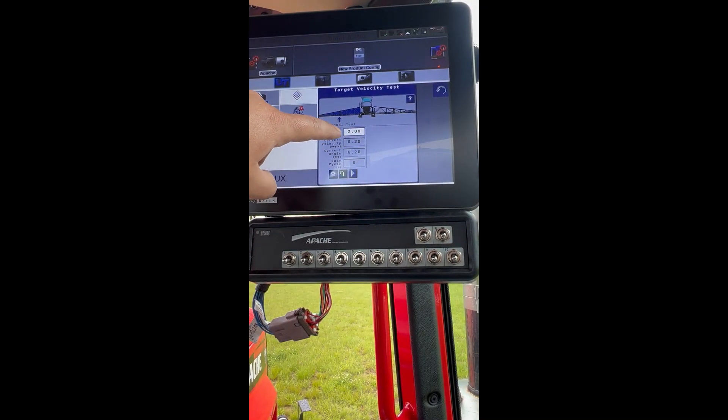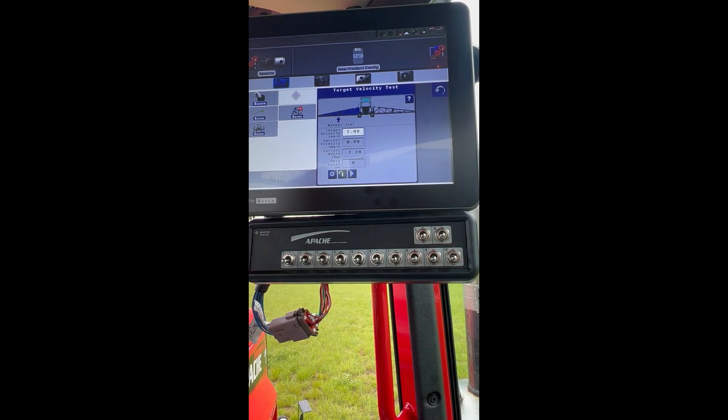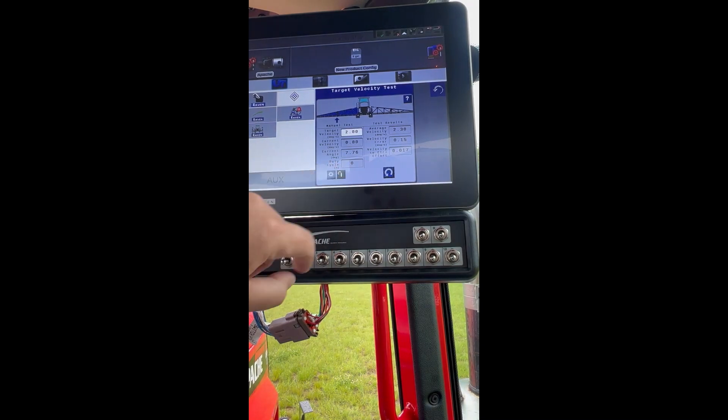So we are at our two degrees. We want to do up first. We are sitting with our rack all the way up and we want to lower our left boom down until it's at a negative two degree angle. So we are sitting at about negative two and we will hit play. It is raising our boom up and we are sitting at about 2.3. It is a little high so let's lower that down.